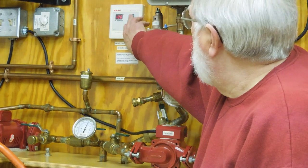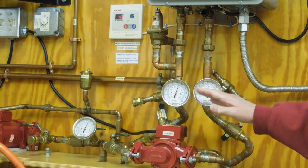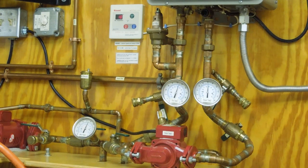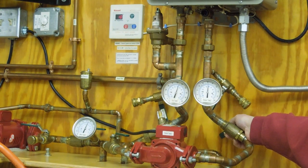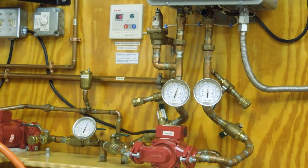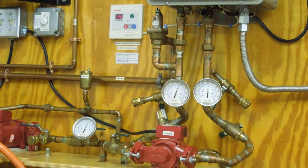I'll look up at my digital readout — it tells me I'm doing one gallon a minute. As this starts to increase, when I see that my return temperature has stabilized somewhat, I'll go back up, turn on my digital readout, and I'll slowly increase this to about one and a half gallons a minute, let that stabilize, and keep going until I can see that the snow is progressively melting.